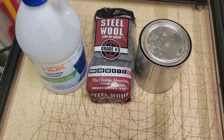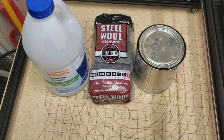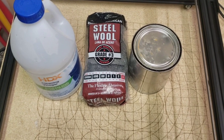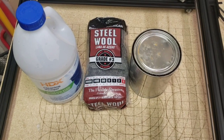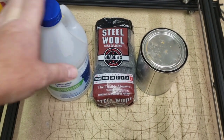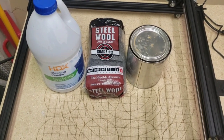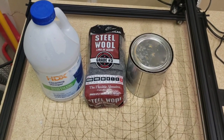This stain is primarily used as a wood ager — it artificially speeds up the aging process of wood. It has different effects on different woods: pine doesn't respond very well, just turning a slight tan, while some woods go to a light gray, a dark gray, or even black with enough layers. You can find all kinds of videos on how to make an aging stain; I have no idea who originated it — it's been around in woodworking forever. I just stumbled on this hack when I was using the product for other things, started burning on it, and was amazed at how much better diode lasers work with it.